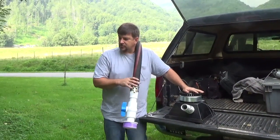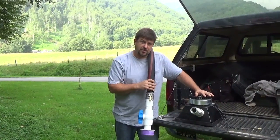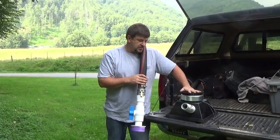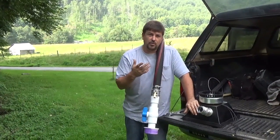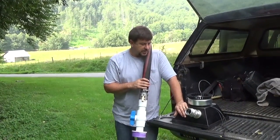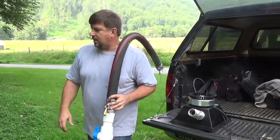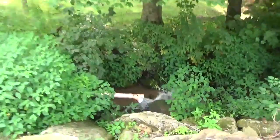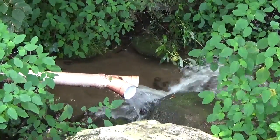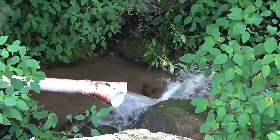That was optimized by Spencer over at Langston's Alternative Energy for this setup. Basically what I do is measure the flow rate and the pressure or the total dynamic head for the project, and that allows us to design your turbine. This is a turgo, so we're dealing with more volume and less head — we only have about 30 feet of head in this one. Our goal is to mount the turgo to that mossy-covered rock. We've hammer-drilled some holes in there, going to wedge-anchor it and see if we can make some power today.